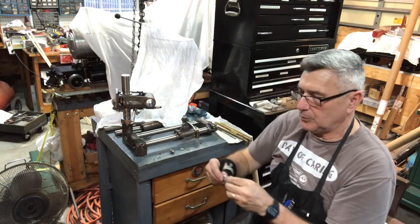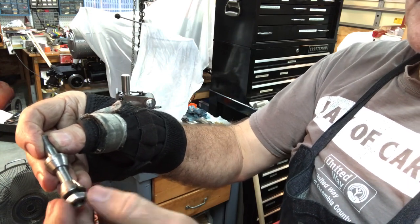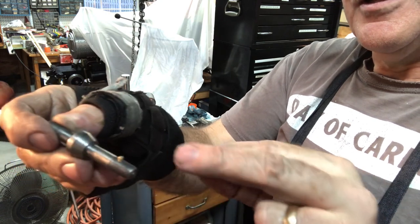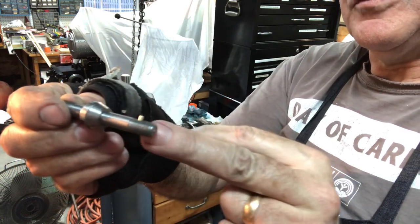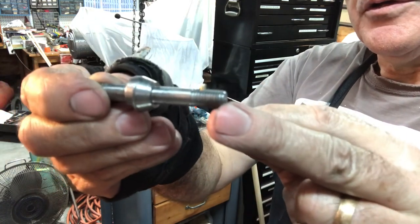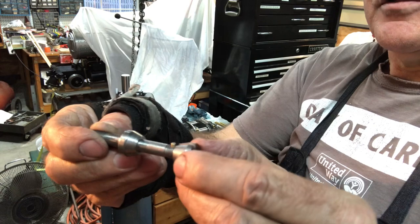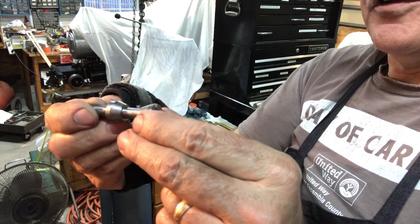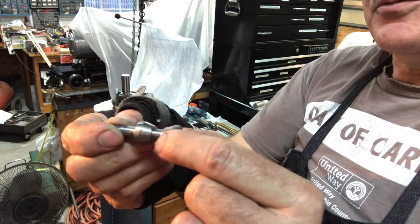This bolt is basically two pieces. There's the cone-shaped bolt and then there's this little cone collet, as they call it. It's described as a cone collet, threaded 5/16-24 with a 5/16 inch protrusion. I've put a little piece of brass in there - it's the only 3/32nds piece I had - as an anti-rotation thing for the collet. The bolt is fastened to the back of the work head base, the tilting bracket goes on top, and the collet slips on for anti-rotation. There's a ball handle for tightening, giving a lot more clamping force because of the 20-degree cones.